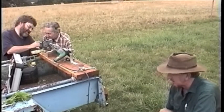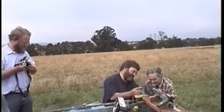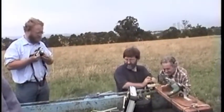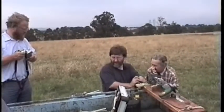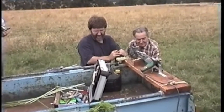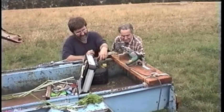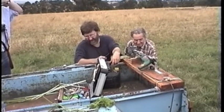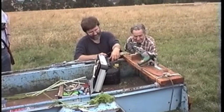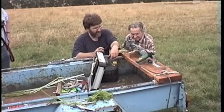My feeling is hydraulic motor. You want to have the stalk go straight across. What sort of speed can you get out of a hydraulic motor? 3,000 to 3,500. Well, what are you operating that machine at? 3,100. But then you've got to work out how much oil flow you're going to need to power 10 units. You see, that might be your problem. Yeah, mind you, a hydraulic drive is not one of the cheaper forms of drive.